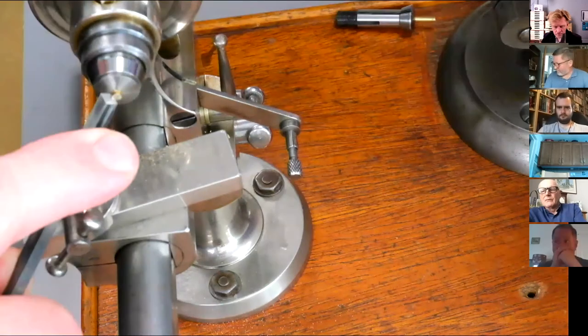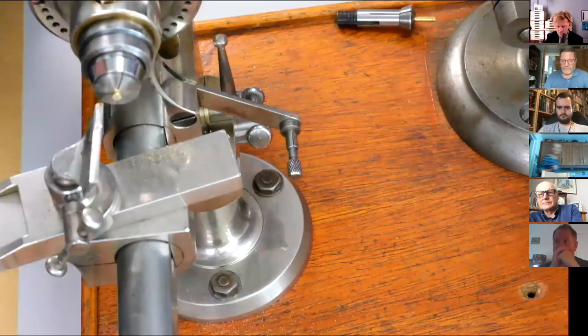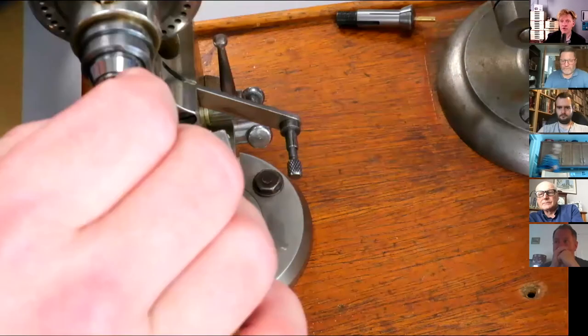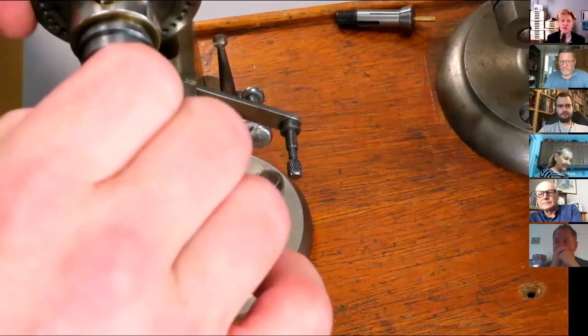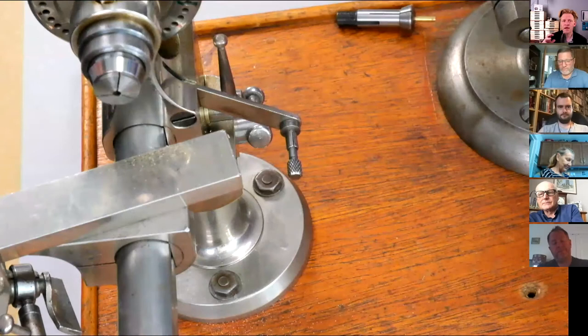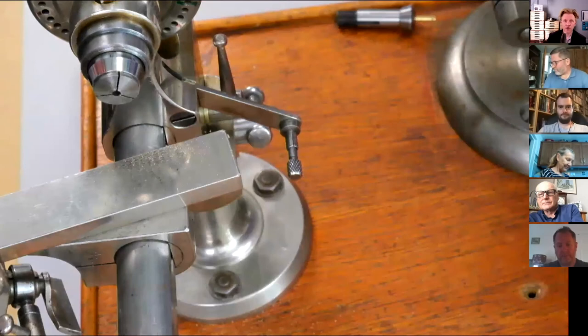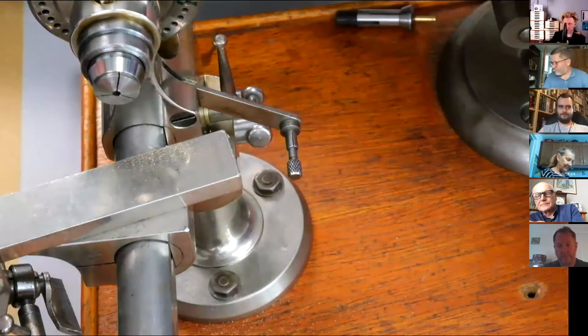Wolfie said he'd be a bit wary about screwing in a click spring in case it works loose and has dangerous consequences. It's a good point, Chris, because on French clocks, of course, the blued steel screw for the click often does come undone. In fact, I think I always now put medium strength Loctite on those when I do those clocks. Dave Allen says just using a screw into a tapped hole would be perfect, if not riveting. Right, so riveting seems the most popular.